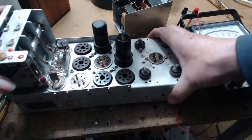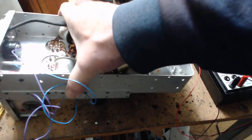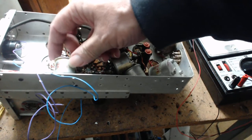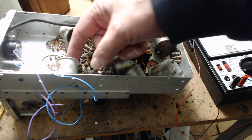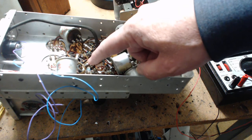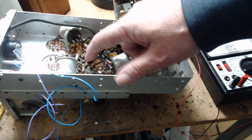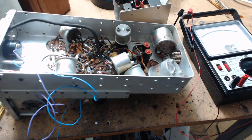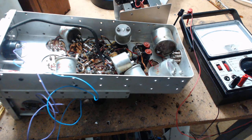The problem with this particular radio: when I went to run the gain control, it goes to capacitor C6B — the middle prong has nothing there. Resistor R1 has been changed in value. Going back to the conversion manual, it tells them to wire this to ground, and it is wired to ground. So many things have been changed at once. I have to go through this radio step by step, section by section, undoing what was done just to have a high-fidelity AM broadcast radio.